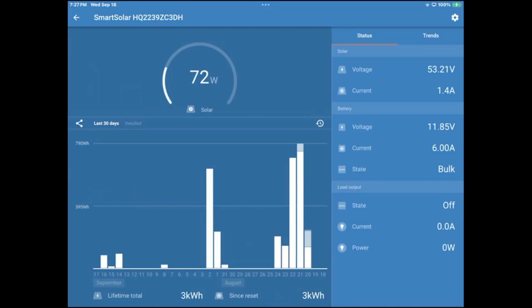You guys can see now that we do have battery voltage from the charger coming in. We got 53 volts. We're drawing between the solar controller and the buck converter 1.3 amps at 53 volts. Our battery's charging now. And the whole thing — this solar controller is something that you need because we want to control our amperage going into the battery and also what the buck converter is doing. If you draw too much, your current is going to go too high, and whatever you're sucking power out of could burn up. This is DC voltage — the danger is you're going to start melting components, burn something up, or wreck a solar controller like I already did. So we're charging up this battery nicely at 6 amps. On my battery charger I'm drawing about 7 amps of power running off of this.